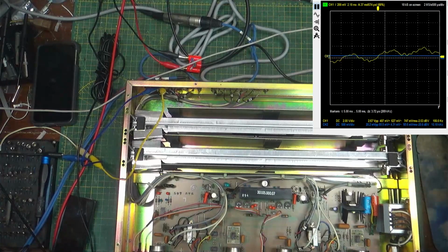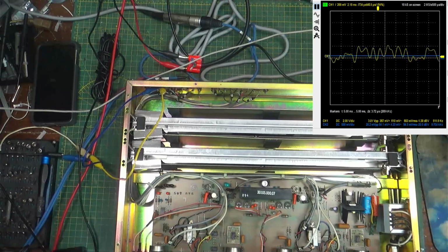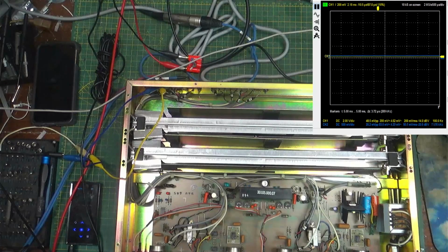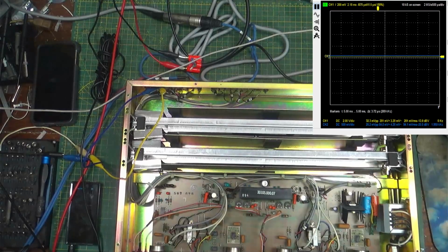How about when I tune it? Oh yeah. Right about there. About 2.5 kilohertz. And when we stop it, you'll be able to hear it even better. There it went. Well, it appears this thing's working. Son of a gun. I'm going to replace the caps over here, go through and get a couple of these other caps and check these big tantalums there in the back. Just because. And then I'm going to let it run for a while, and then I'll be back and we'll see how it does.